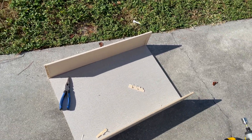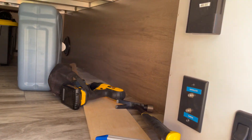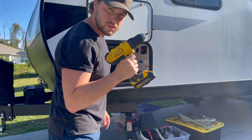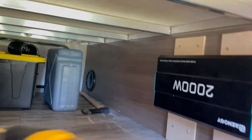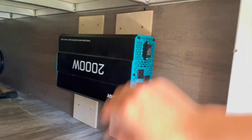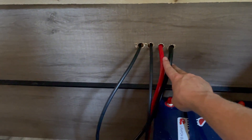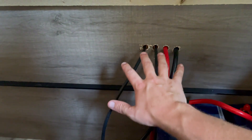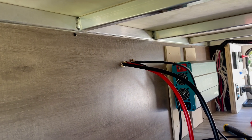There was a drawer underneath the bed, so I took these two pieces of wood and I'm going to put them behind this little panel back here in the garage so it'll keep the inverter from falling over. It's not super pretty, but it's up and it's not going to go anywhere. Just like that, the new charge controller is in, and I got it facing the same way so I can keep running these wires this way. I've got the inverter wires here, charge controller wires here, both threaded through to the other side into the garage. It's not beautiful, but functional — inverter in, charge controller in, wires in.